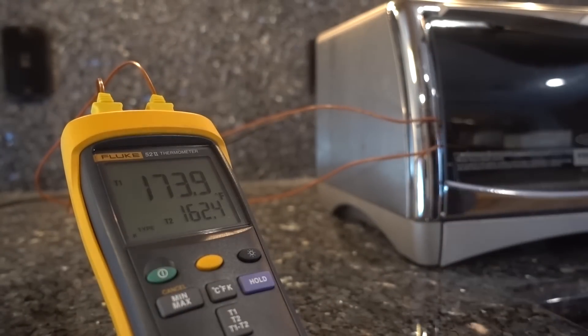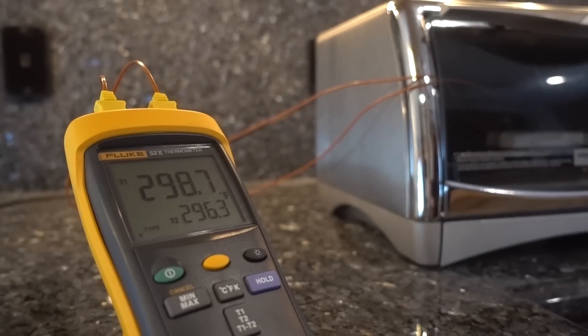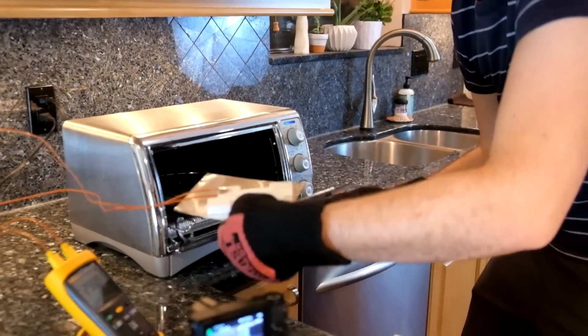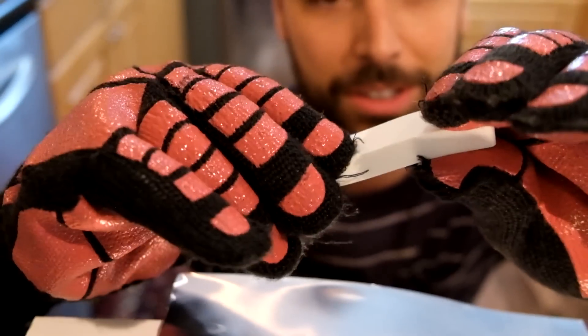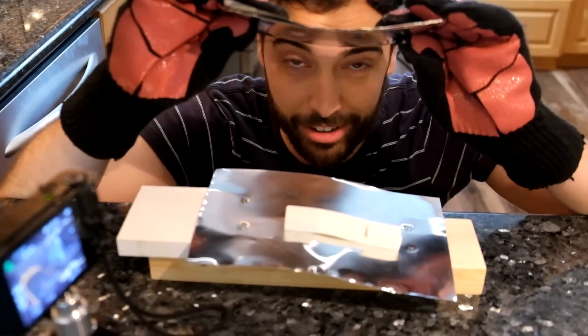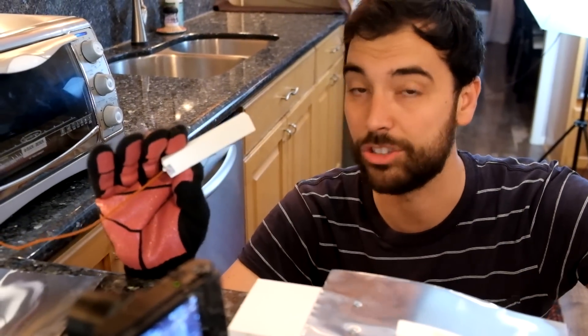I can already tell we're going to need thermocouples. Carefully take these out. Hey, that's really easy! This is totally going to work. For the final one I'm going to press down on it with another sheet of metal for even pressure all the way across. We only bent one because I wanted to measure how fast this dropped from 300 to 180 degrees — you shouldn't bend this when it's under 180 degrees. So I think we're going to go on the full scale test now.